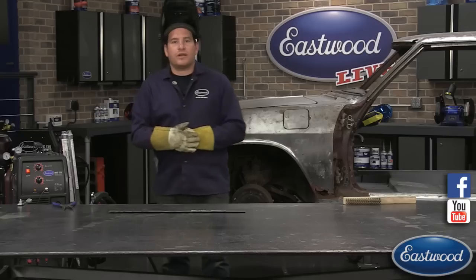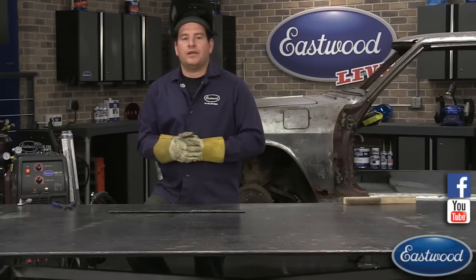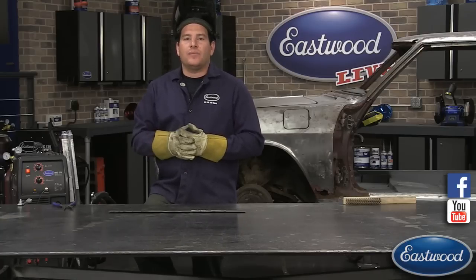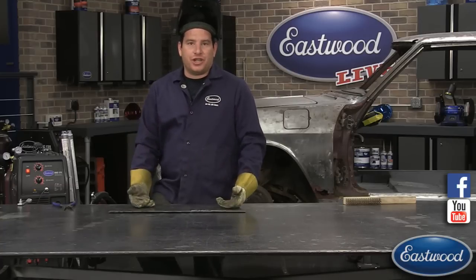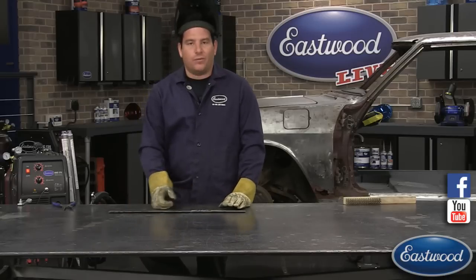Marcus on YouTube would like to know, is there any difference in the weld when using .024 to .030 wire, the different wire thicknesses? So Marcus asked a good question. He asked if there was a difference between .024 wire or .030 wire. That would be the thickness of the wire that's being used. The thickness of the wire would change how you set your machine up, but it wouldn't really change how well it welds.